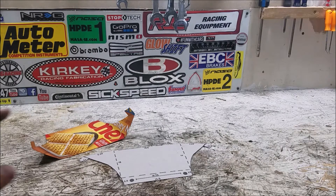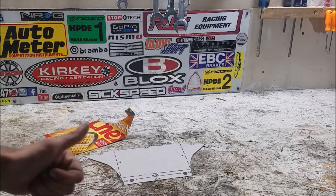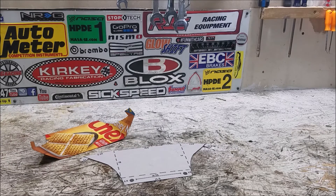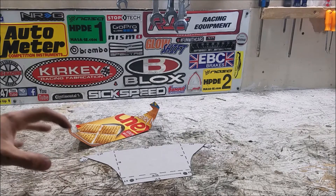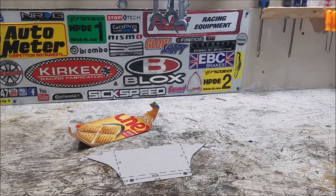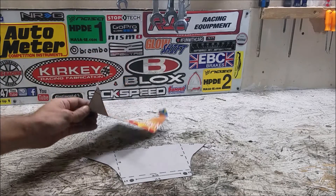Make sure it still works and then bolt it onto the car. My fan is still working — one way to test it is if your car is on and your AC is running, this fan should also be running. If it's not running, it's likely damaged — could be a fuse, a seized fan, or any number of problems. They're pretty cheap and easy to replace, and people have done a lot of research on alternative fans with different part numbers that are essentially identical. But this scoop adds one extra bit of security to make sure you're getting cool air, especially in a track scenario where you're putting a lot of strain on the car. If the fan fails mid-session, this will keep it alive so you can get back to the pits. Without it, you might kill your power steering pump on a track with a lot of turns.